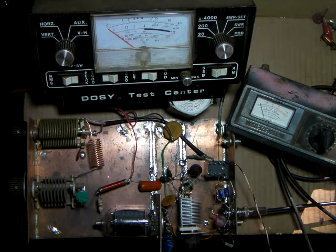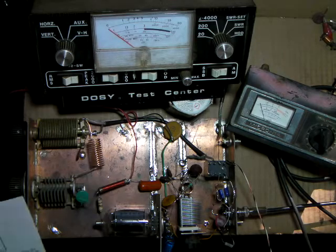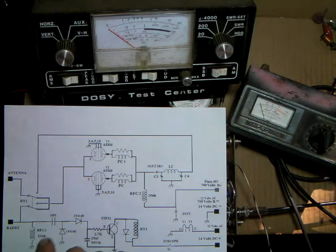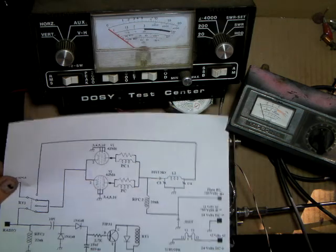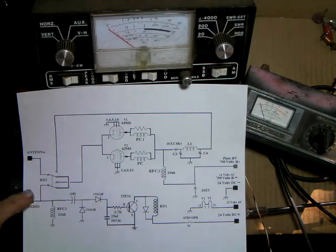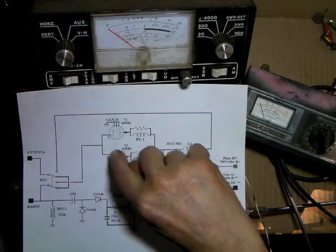That's pretty much it. I'll come back in the next video, put that tube in, and see what we come up with — it might even work with this same load. I also want to call your attention to something in the original schematic where there are two tubes and no tuned input: there's one choke here that's essentially out of the circuit since its inductance won't bother 27 MHz.